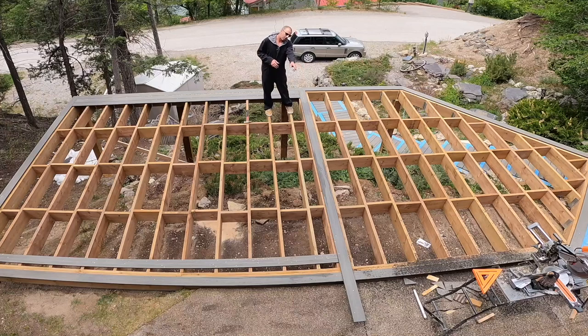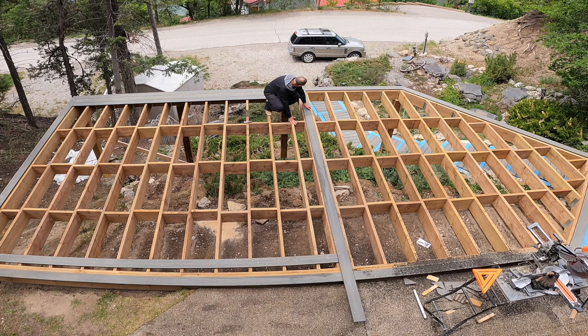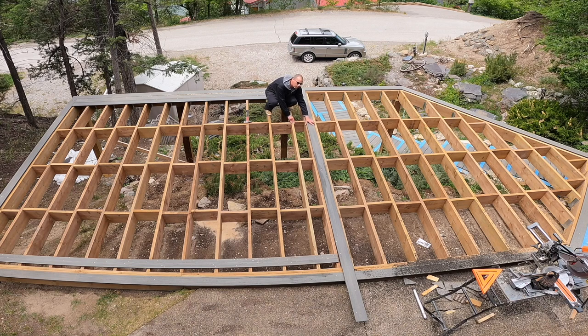I got my center band backing in here, and on these end cuts, I do expect a little expansion and contraction, so I'm gonna leave like a business card thickness in at each end. But you can see with my backing in here, I added another 2x10 joist through and nailed a 2x4 to the side of this one. Should work out perfect for the application.